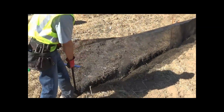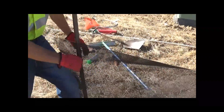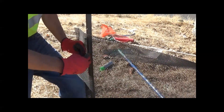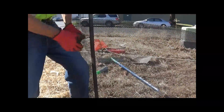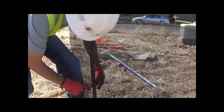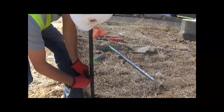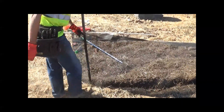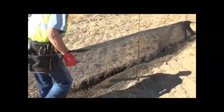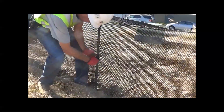At this point you start tying the fence with plastic zip ties, right at the climber barrier crease and right at the top — leave room for that crease to bend down. Russ will put another zip tie about halfway down, as far as his arms can reach, so one person can do it from one side. When Russ hangs the fence, he pushes back and fills the soil right at that point so it doesn't kick out while they're working on the rest of the fence. We do that at every single post.